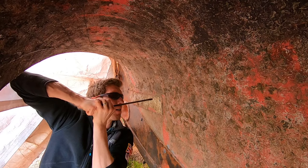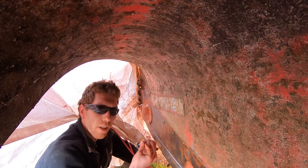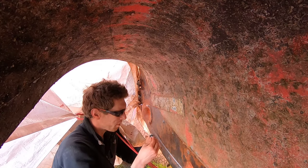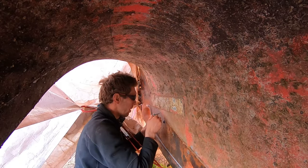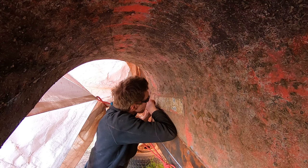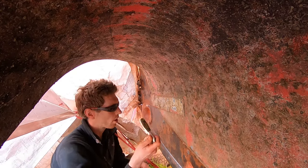Come on. Tell you what, never am I ever putting my own anodes on with a flathead. Why use a flathead for something like this? I don't get it. Not a hope. Nah, they're completely seized. The only successful method for this is to stitch drill. Even a wrench can't get them off.